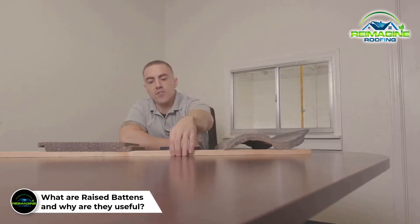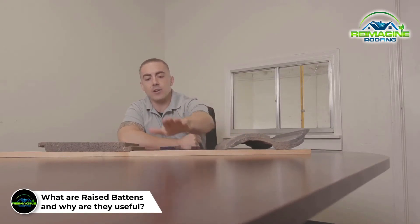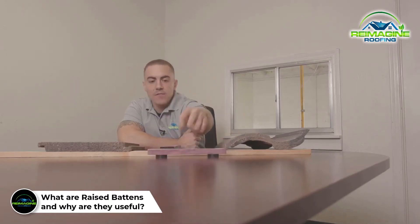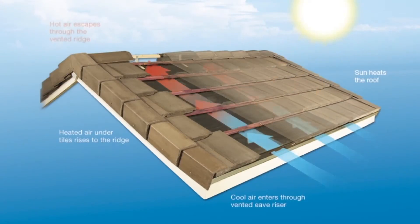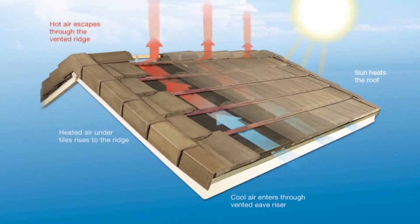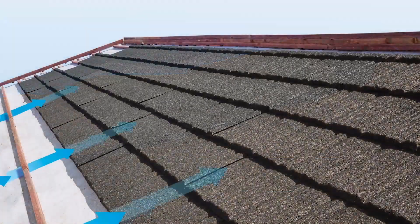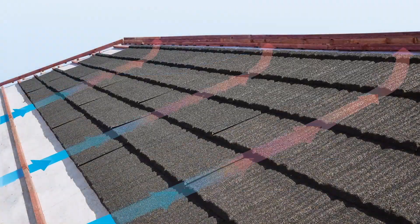The first issue is that flush to decking does not allow air to pass through. If we opt for an upgraded elevated batten, this allows air to rise in from underneath the roof and escape through the top portion called the ridge. This means that we can take hot air from the attic and help it escape through your rooftop.